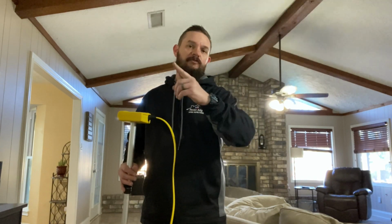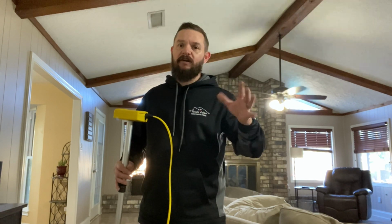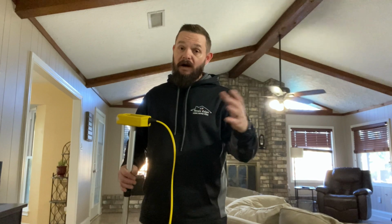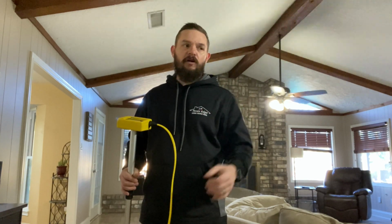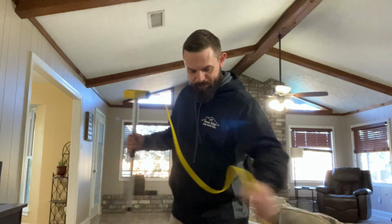And we're going to take measurements around the structure, and we're going to try to see if we get anything that's greater than about 1.5 inches. For our general purposes here today, we're looking for it to be under 1.5 inches of level from the benchmark area. Anything above that may raise some concern. If it's below, probably not a big deal. All right, so let's go check it out.